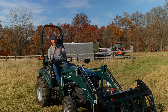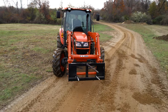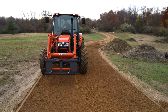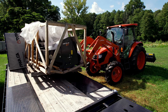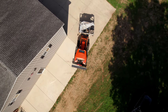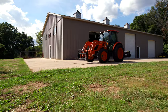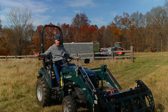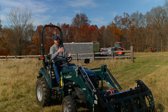This next one is good and bad. From a front-and-back perspective it's great, and that's going to be a cab for your tractor — really effective adding hundreds of pounds on the backside to keep the rear wheels planted when you're using your front end loader. But from a tippiness factor side to side, that gets more of your center of gravity higher up, which makes for a more dangerous situation. To offset that, you're definitely going to want more weight down low — like in those tires with liquid ballast and Rimguard, wheel weights, potentially wheel spacers or dual wheels. So that one's a double-edged sword.